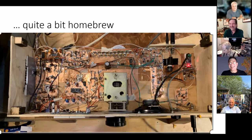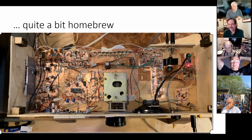You're doing real fine. Well, we had a problem with the Simple 40s because we have so much audio. The three transistors we have up there driving the fourth audio transistor, by the time we get out of that, on strong signals, we're actually clipping our 386s. We got so much audio.